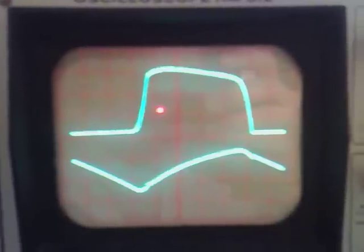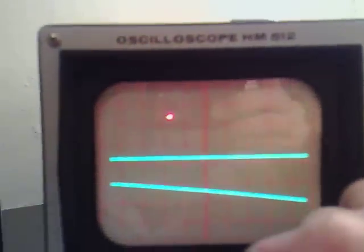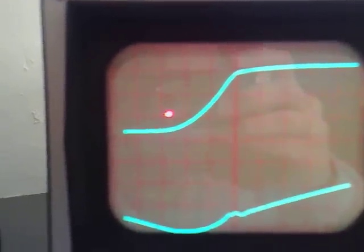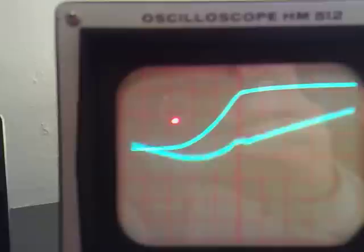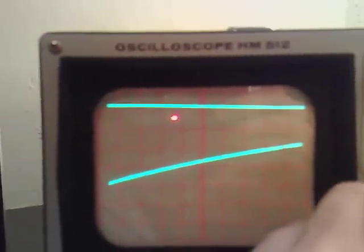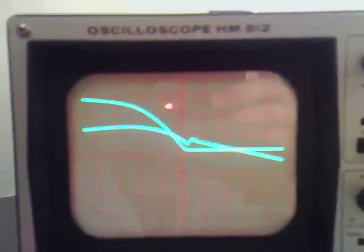I think that's the counter EMF. If I put this up a couple of ranges now and use the delay function, you'll be able to see that little twinge I was talking about that overlaps where it comes on, and if we move further down the waveform you'll be able to see that other little one there when it goes off.